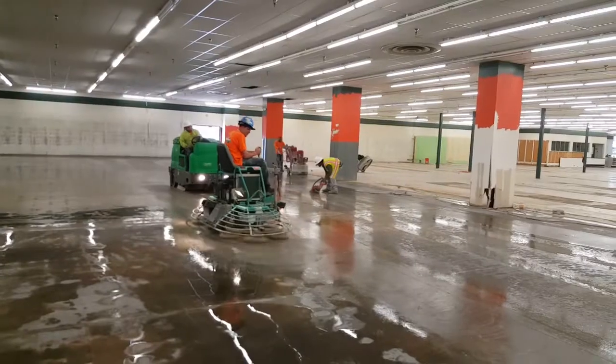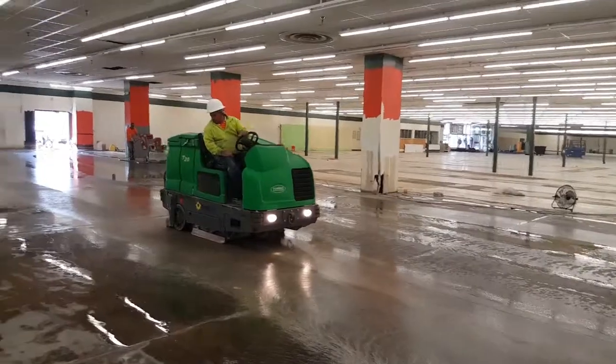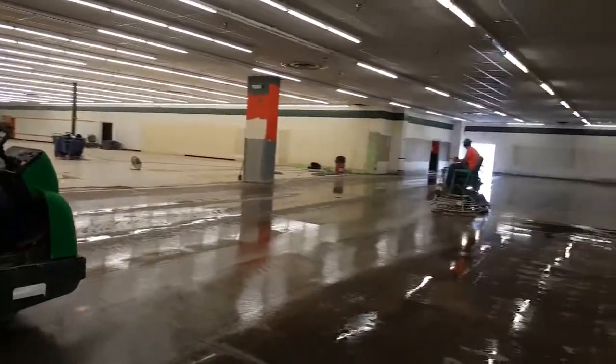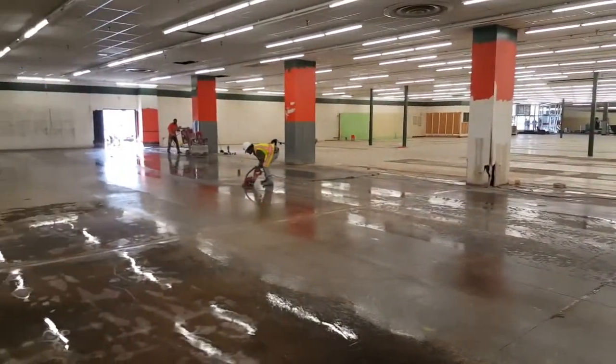In addition to having the 70 diamonds on the paddles of the power polishing, we use a cutting agent that helps cut the concrete faster and better and has more components to it than the normal additive that you use. Then we use a densifier that has more solids in it. Then we cut the floor some more and put some special sealer on it. So the total package is called power polishing and it includes the diamonds and the liquids that we use along with the power trowel system and a very fast scrubber.